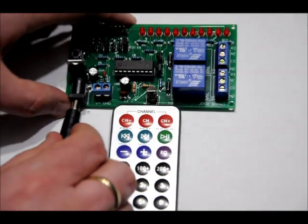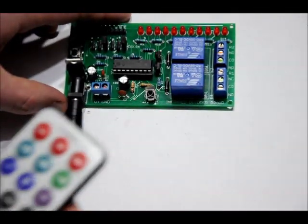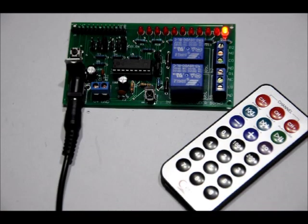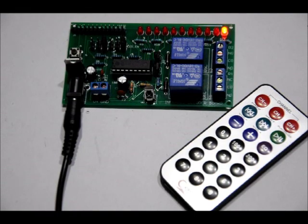I've got my program jumper connected. I'm going to plug it in and press the buttons in order: 0, 1, 2, 3, then 4 — and I'm actually holding 4 down right now. The indicator LED stays on to tell me I need to let go before I can program in the next number. Then 5, 6, 7, 8, 9. Once I've programmed in that last code, the indicator LED stays on telling me the code is programmed. Now I'll unplug the unit.